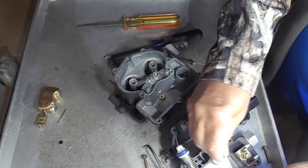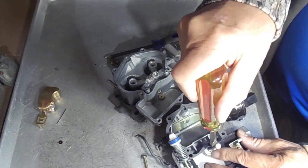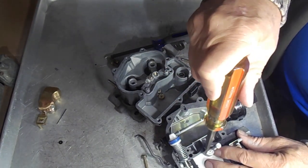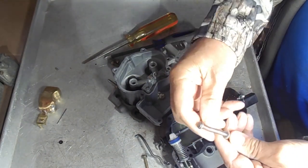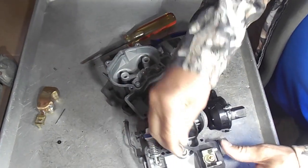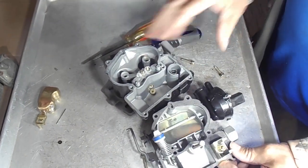This had fallen out — it's actually staked down. You put it in there and stake it; get a chisel, not a screwdriver. Stake it in a couple places just to keep it in there. You can see this one's bent — it's got to be straight. These aren't available, but we're thinking about getting some made, so don't get your hopes up until it happens.